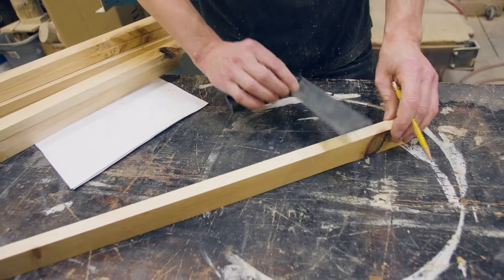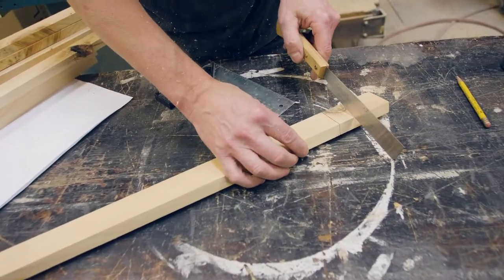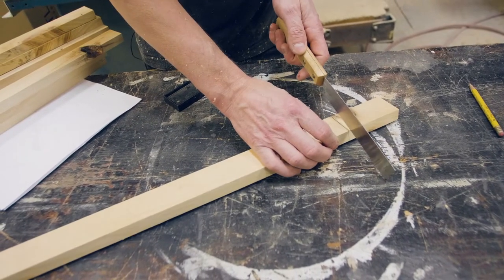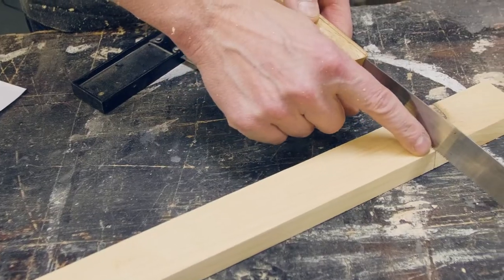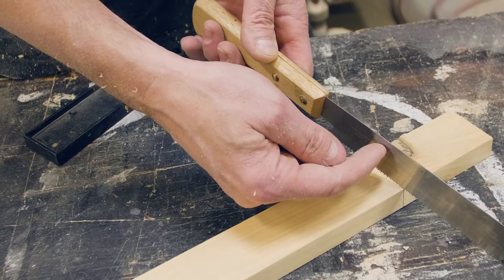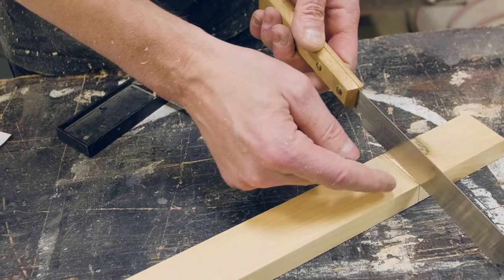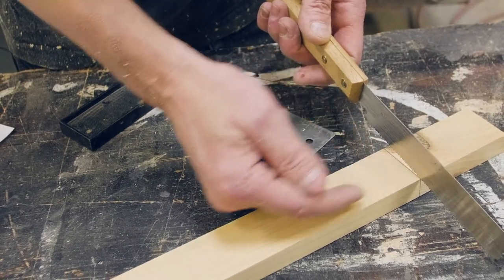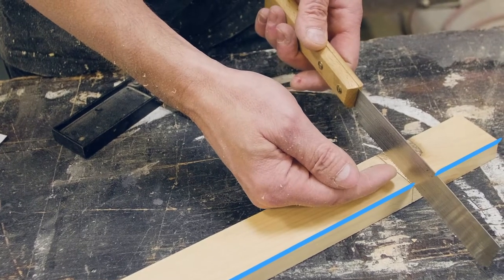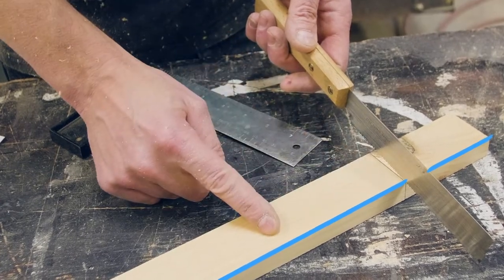Okay, so I'm making a line on two sides there. Normally a saw is a very reflective surface. When you cut, if you cut at an angle, the mirror image of this bends in the angle and doesn't read true. If you hold it exactly 90 degrees, this line visually through that mirror image of the saw will run true and straight. And that's something, when you get used to this, you watch that, and it helps you keep this saw perfectly 90 degrees to the board.